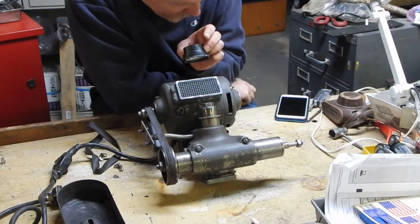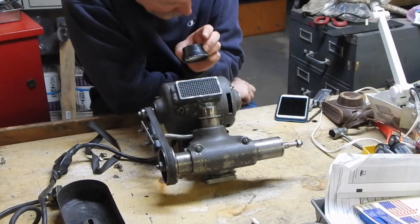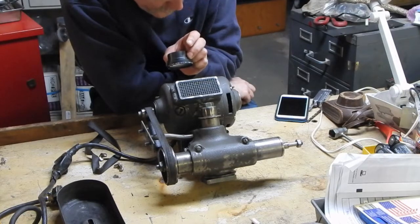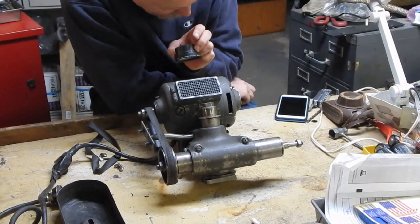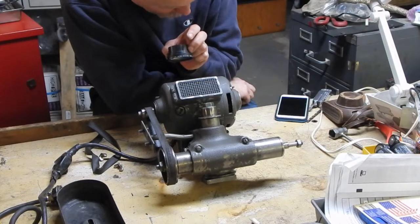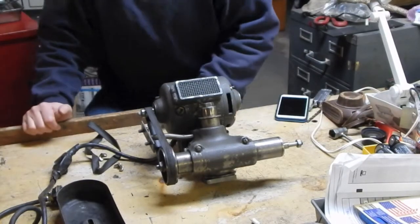Full load RPM is 10,000, no load RPM is 15,500. It's a half horsepower. This is a model number 810-210. Serial number 21352. Okay, this goes on to explain the different speeds, the different diameters, just like my other one. And it looks like we're looking at combinations of pulleys here. Number 1, number 2, number 3, and number 4 are the pulley numbers. So there should be 4 pulleys in this set. There's 2 on there. There should be 2 more, and I didn't see them.